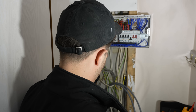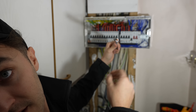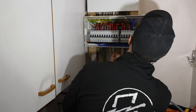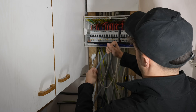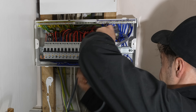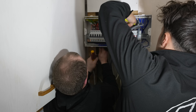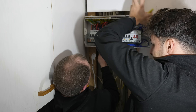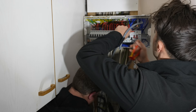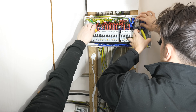Some of you are inevitably going to be wondering why haven't you changed that consumer unit — there are a few non-conformities in there, it's messy. Here's the thing: when you're hired as an electrician to do your job, it's very important to pick your battles. You want to leave the customer with a job that is safe and be reasonable. I always try to have the principle — I might not be able to fix everything here, but I want the customer to be left safer than how I found them. Most regs are not retrospective; you can't cast a modern brush on past installations.